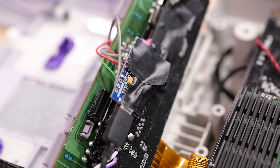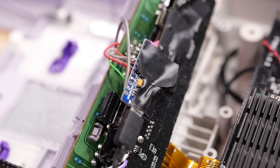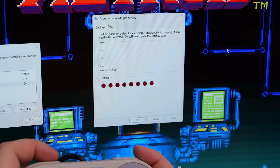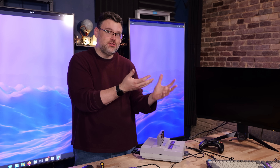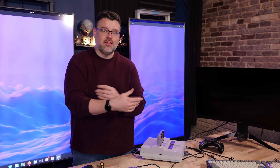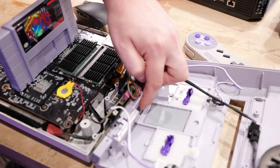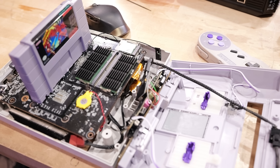For the buttons and the eject lever, 3D-printed accessories — the 3D printer really does the heavy lifting here and just solves a lot of problems. How does the Super Nintendo controller show up on a PC and become usable? Fortunately, that's a tale as old as time. There are tons of adapters that convert the signal pattern the Super Nintendo uses into standard HID USB. There's a little microcontroller that takes the proprietary Super Nintendo signaling and converts it into USB joystick signaling. It's two-port and uses the original connector PCB, so it's pretty easy to modify. In this case it was about a $4 conversion kit plus some soldering and wires.